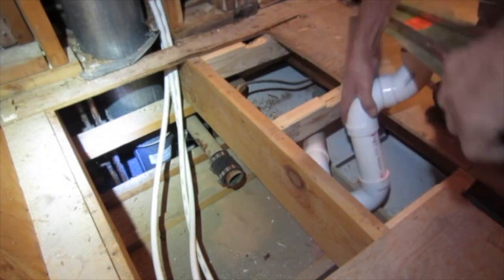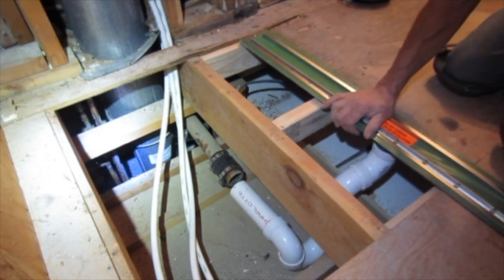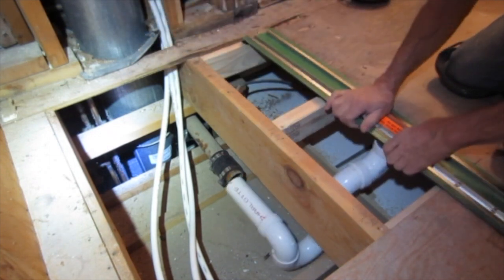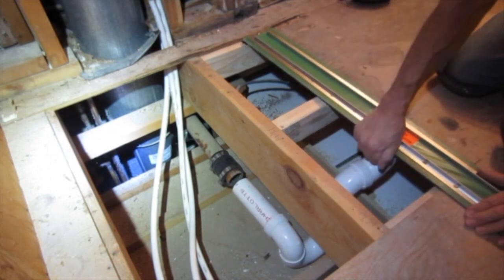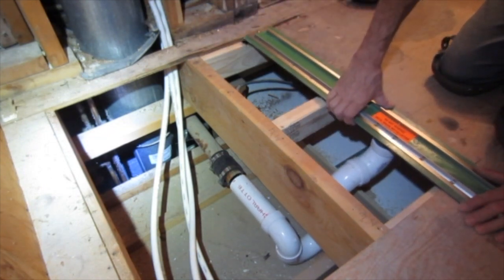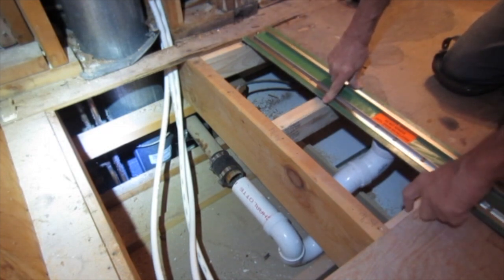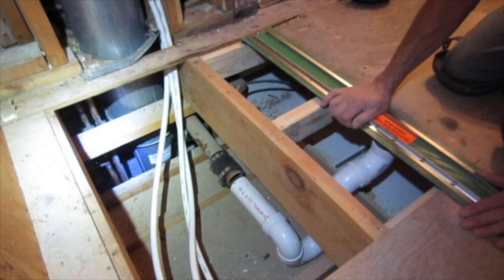You want to be sure that when this is all in place and hooked up that you're square to your back wall and level — which the backer board going underneath will help with. It's also helpful to remember and locate where the blocking is for when you go ahead and screw the drain down, because you're going to want to screw into it. Notch those out so this fits.